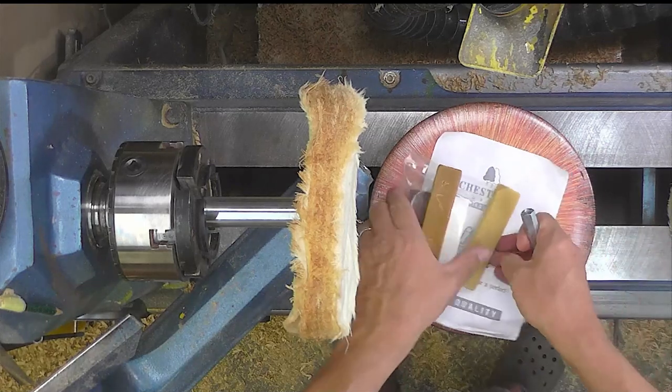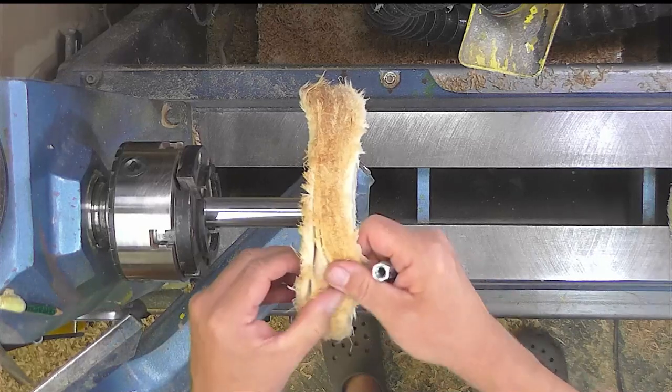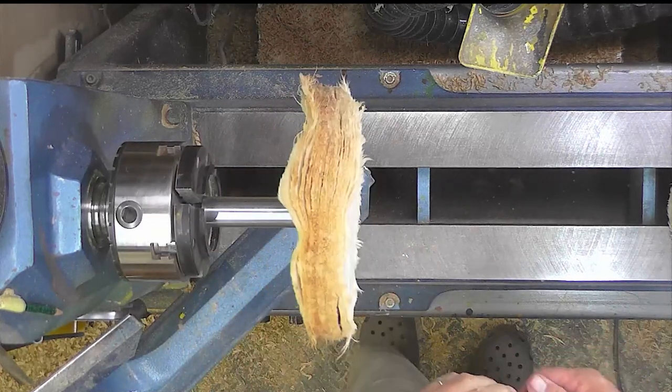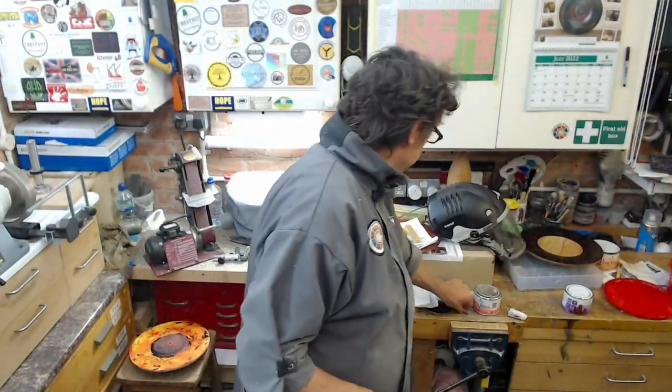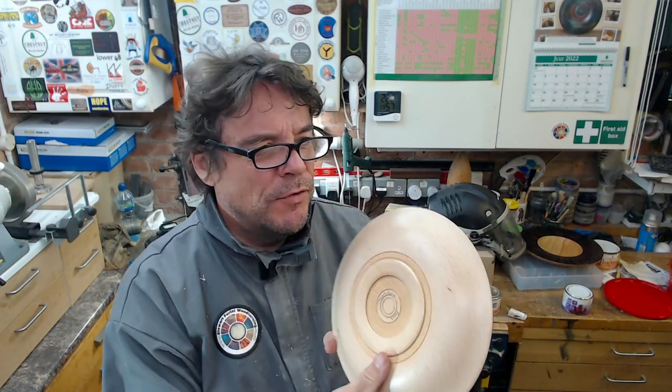You can also get a stick of micro-crystalline wax separately and use that as your third compound. The other mandrel you get can be held in a drill chuck and the mops just screw in. They're all loose mops — not stitched together, separate leaves — but when they spin at a maximum of 1500 RPM they'll bunch together, become much stiffer, and improve the finish of your wood. The reason I need to improve the finish of this piece is it did have a little bit of finish on it, but it's got a bit worn off as it's been shown around in various demos.